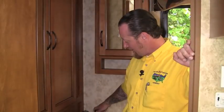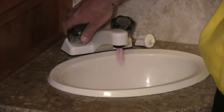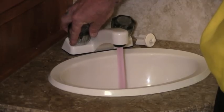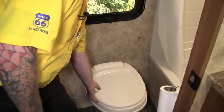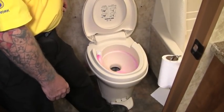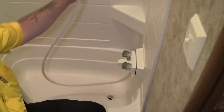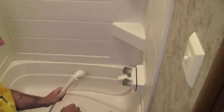The PEX plumbing will take freezing even if there's a little water in it — it's our fixtures and plastic fittings that do not take freezing; they will crack. I usually just start with the closest faucet and run both hot and cold until I see pink. Same with the bathroom sink — nice pink flow there, and good pink on the hot water side as well. Next I'm going to do the toilet; this one is a foot flush so I'll press it until I see a good flow of pink to get it up in that valve. Here in the shower I've removed the shower head and brought it down to control the flow.